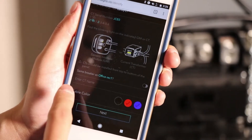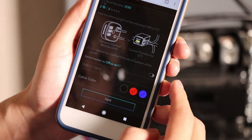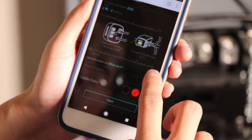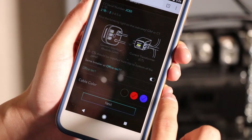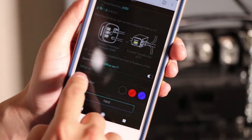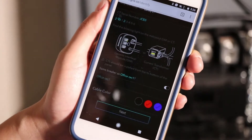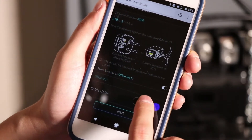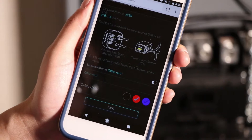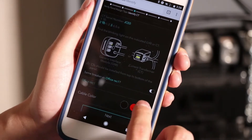For the second CT, it's on the same three-phase breaker as my first one, so I'm going to say it's on the same breaker. You'll see 'office receptacle one' is automatically copied in. I'll select the cable color — the phase of that circuit — which is red, and hit next. For my third CT, also the same, but this time blue.